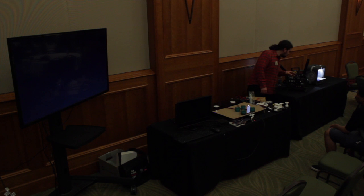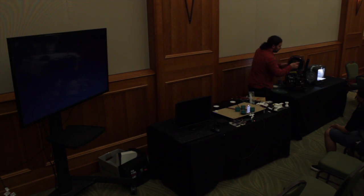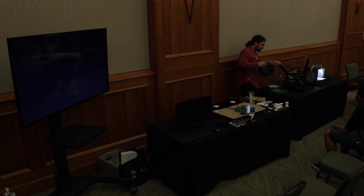I know it's really hard to see, but these projectors are all sprocket driven. They've got little toothed sprockets that help feed the film through, and there's a take-up reel that pulls it all through. I used to work as a projectionist, and I still fix projectors in my spare time. Essentially, this needs to be rewound, but the film would just run through the projector. I'm not going to bother threading it because the projector doesn't actually work, but it just runs through all of these rollers and sprockets, and then just takes up over here.